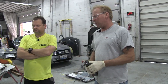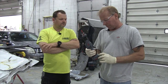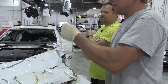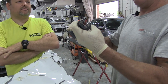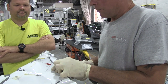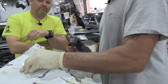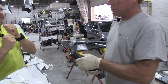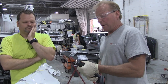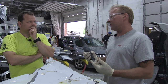So that's a good reason. The speed of it — just grabbing it off your toolbox and going. It does have a battery indicator. Two bars. Will it cut through this sheet metal? It should cut through it, no problem. That blade does have some missing teeth, but we'll see. And that was double metal right there — you're going through both sides. Something like that is real precise too. It's easy to control because it's small, and it's heavy enough that it doesn't shake a lot. And what I like about this as opposed to the air is the air is all or nothing — when it's on, it's going full bore. You can dial it in with an air regulator, but this one actually controls speed.